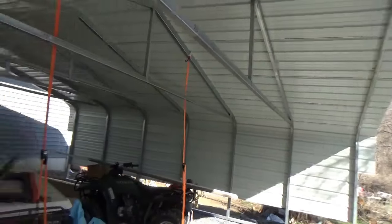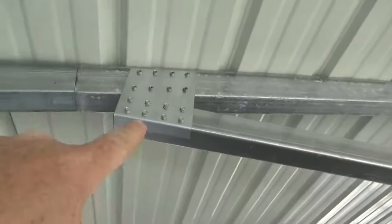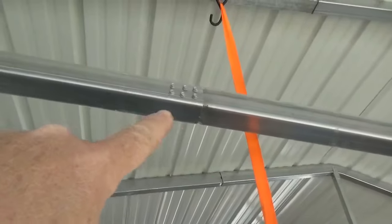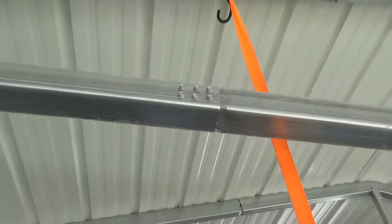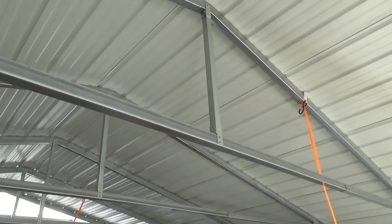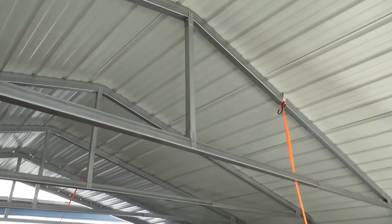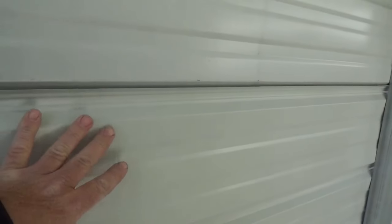Assuming you get all the ribs up and bolted together, please follow all the instructions — particularly for these cross braces and collar ties. They're very specific about putting all the bolts in according to the pattern. Get all the braces in properly because this is what handles your snow load. As you're pushing down on top, this is what supports that snow load.